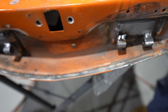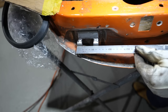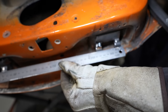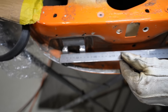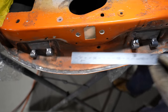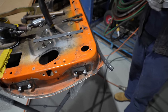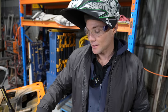They're aligned beautifully. You've got a straight edge there, Mick. We'll just show you a little trick, what you need to do if you're going to do these things. So you want a good straight edge to run along the edge of those barrels. And once they all align, and they're exactly in their right spot, and I mean exactly, because if they're not, you'll have ongoing issues with your hinges and your pins because they don't turn and they don't align the way they should. But if they're on really nice and they match the barrels on the car, that'll be his next little job. Once that's done, they fit really well, Mick. Yeah, well, that there is done perfectly, so that's so important.